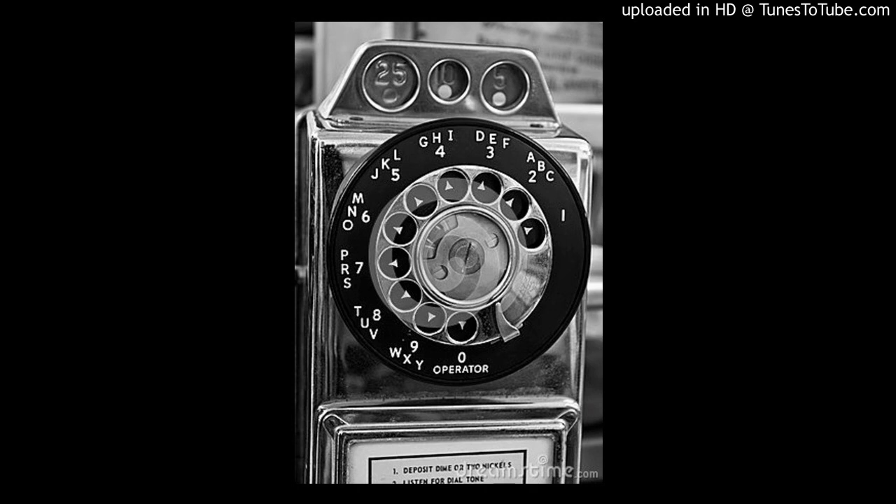The semi-dialtone first did get replaced with real dialtone first in many areas, and that started happening in the late 70s before the old switching systems were replaced. Here's a recording of an NX-1 in Northern Florida, which clearly has dialtone first. It's also a strange and perhaps unique anachronism: a three-slot touchtone payphone with dialtone first. How the NX-1 is detecting the ground signal from the payphone is not clear. It may be that the regos in this office are able to detect that ground without cutting battery, just like whatever equipment used to do that in the semi-dialtone first systems in the steps. That's something the Bell system would never do — they would always drop battery to test for ground. Here's a local call; notice how I can dial the first two digits without putting the coin in, and you certainly could call operator with no coin.